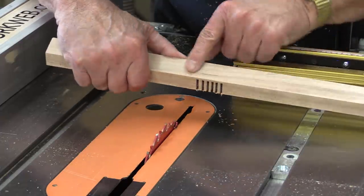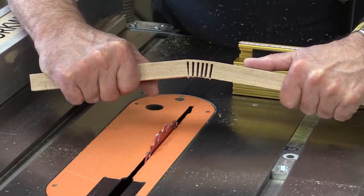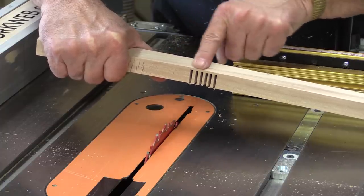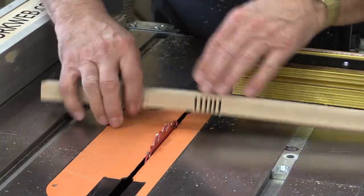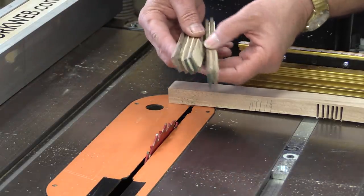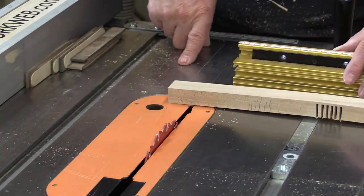My wood might not bend all that pretty because I don't have nice straight grain — I just grabbed a piece to do a test with. But you can see that's what kerf cuts do — that's one of the ways you bend wood. Typically you'll also moisten the wood and apply a little heat, and if you make more kerf cuts you can actually achieve a 90-degree angle. Great idea Ron — using tongue depressors or little strips of wood, stacking them against your fence and taking them away one at a time.